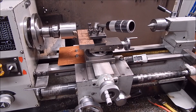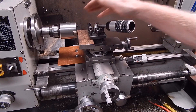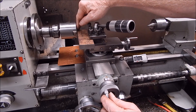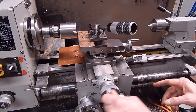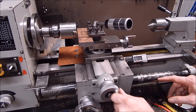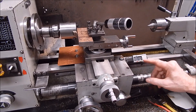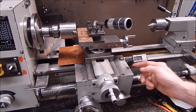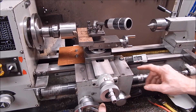To keep this simple, I'm not going to use the milling slide. We're just going to use the tool post and a fly cutter. The main thing when you set this up and clamp it is to make sure you get the point of the cutter against the face of the job and put an indicator on the side of the carriage. Take a reading all the way across to make sure it's the same at both ends - don't trust your eye. These little magnetic indicators are invaluable for milling or drilling on the lathe.